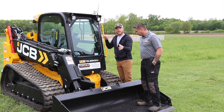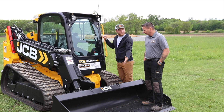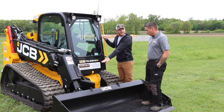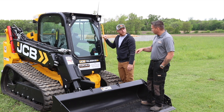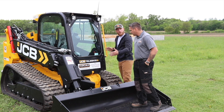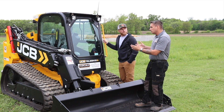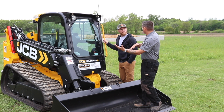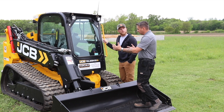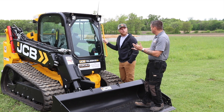The H-frame design underneath the cab keeps it rigid so force travels the length of the chassis and not up the arm. And with the offset arm, people worry it'll twist with repetitive force — the design helps address that. The offset cab also helps with weight distribution for tip stability. So if you're on a slope, you don't have to worry about the machine rolling because of the weight of the boom — it distributes evenly throughout the machine.